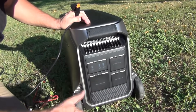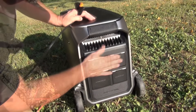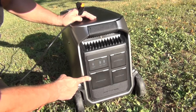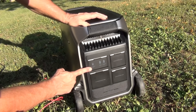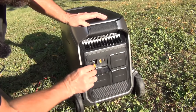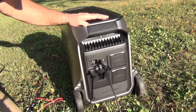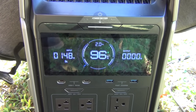On the rear of the unit you have all of your connections for charging. There's an extra battery port — this is for taking it all the way up to 48 kilowatt hours — you can add stackable extra batteries for extra expansion power. There's also another AC power input/output port. Here we have our AC charge and solar inputs. You can see what our plug looks like — simply plug that in, fits perfect, and now we're charging with the power of the sun. On the input side we have 148 watts of power going into the unit.